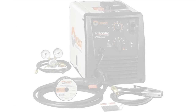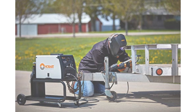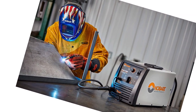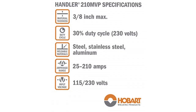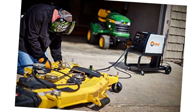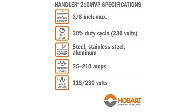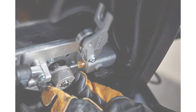Most household projects don't need steels thicker than 1/8 inch. The machine came ready to use, though some people are confused because it ships with a flux-core FCAW setting — you need to either use it as an FCAW welder or swap the wire and add a gas cylinder for GMAW. After a few years of use, I had two main complaints: the ground clamp claims to handle up to 1.5-inch material but realistically can't clamp beyond 1 inch, and the 20% duty cycle gives only 12 minutes of non-stop action per hour. Still, the Hobart 500-559 helped me break my cocoon as a beginner.